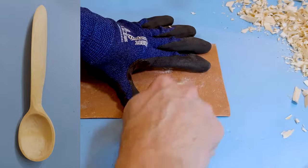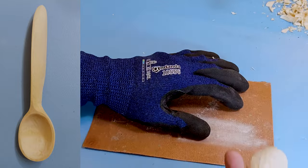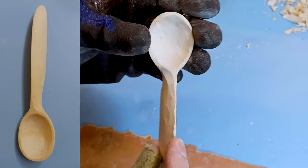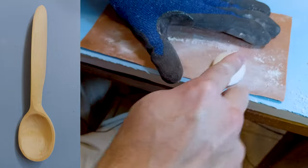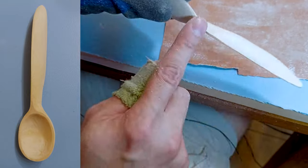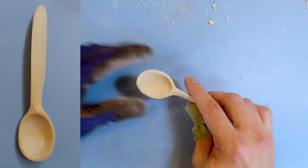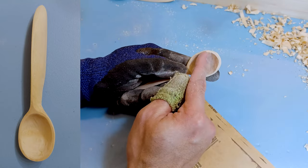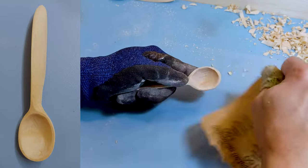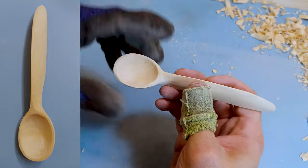You can already see it's removed a whole bunch of those scalloped cuts and it's starting to get some nice rounded surface. I'm going to do that to the rest of it, working a little more off camera so I have more dexterity — I like to do it at the edge of my table so I don't bash my knuckles. Bottom of the spoon is good. Now that I got it mostly sanded, I'm going to smooth off these edges a little bit more so it looks more like a feather. Now we got to get the inside — this is going to be a little bit tedious. It doesn't have to be absolutely perfect on the inside, but you're definitely going to want to use your thumb in there. The basswood is pretty easy and nice and soft to work with.